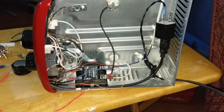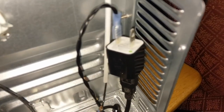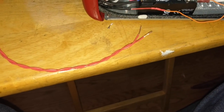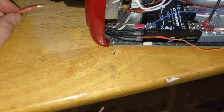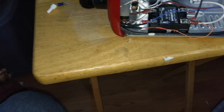Now it's time to wire up our plug. I only have 22-gauge wire laying around — kind of tiny. But this adapter only pulls 150 milliamps so that's nothing. For safety's sake I'm doubling it up. The thing I wanted to show is when you twist wire together: you'd think you just sit there and twist it down the line, but it'll probably unravel because you're putting torque into it and it wants to separate. The proper way to twist wire and keep it together is instead of actually twisting, you're wrapping them around each other — just picking them up and moving one in front of the other. You're not exerting any twisting force, just wrapping them around each other, and that's how you make a nice coil that doesn't come flying apart.